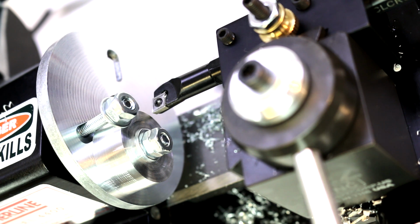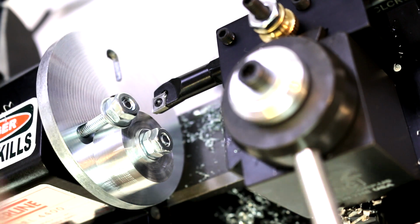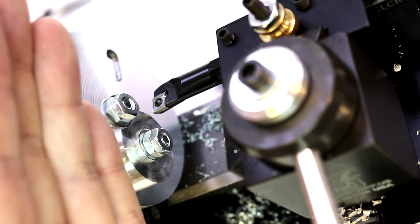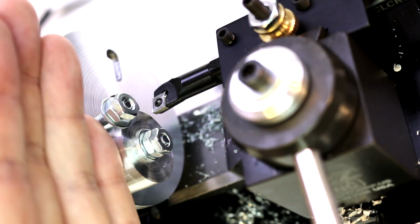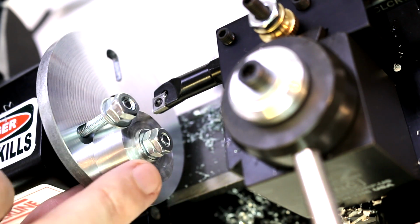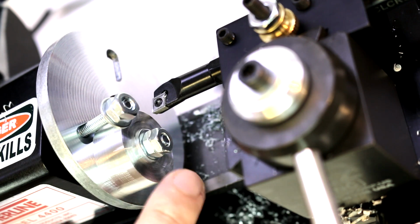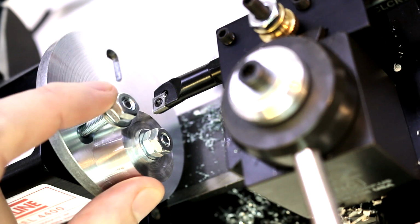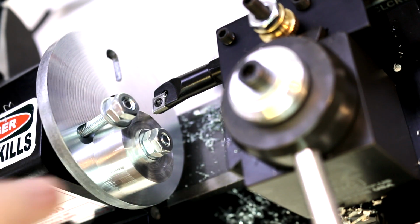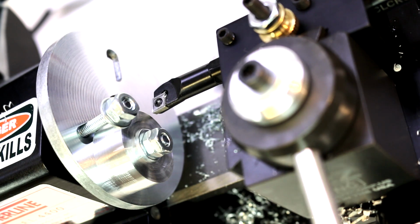Always safety glasses. So always remember to put your safety glasses on. If you can, keep your body out of this plane so that if a workpiece were to come off, it's not going to hit you, and make sure that there are no other people in that plane. Again, with a hole, it makes it quite easy because we can make the workpiece captive. But if we were just trying to clamp this by 2 or 3 or 4 edges with nuts like this, then we would be in a much worse situation. But we do have that hole in this example, so we're going to use that.